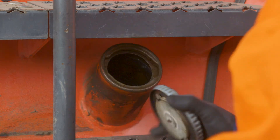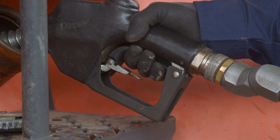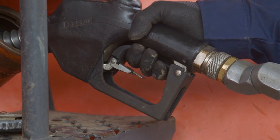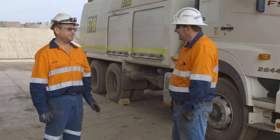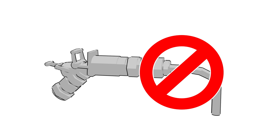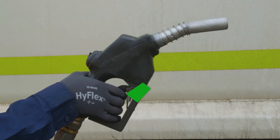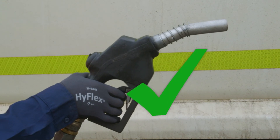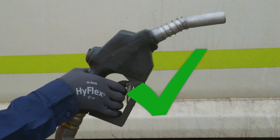Refuelling is part of general maintenance, but you should only refuel a tyre handler when required and when you have been trained in site-specific refuelling processes and procedures. Depending on your site rules, you may also need permission from a supervisor. Never use a fast fill system with an open attachment. You should only use a standard flow nozzle, like those on a petrol station bowser, or a fast fill specialised fuel tank receiver with a vent fitting force gun that will close off when the tank is full.